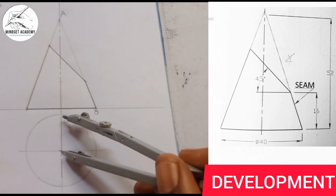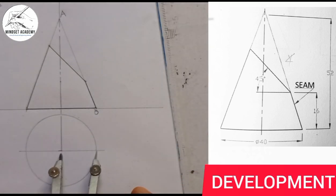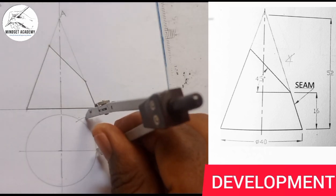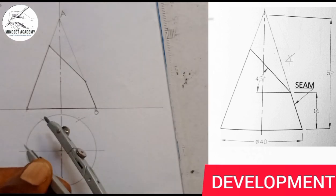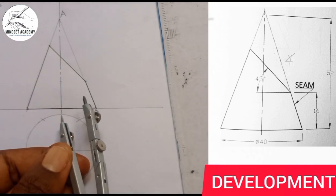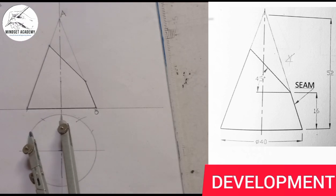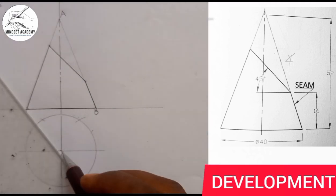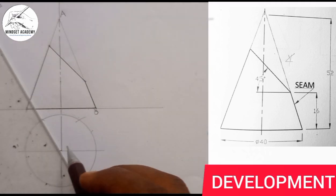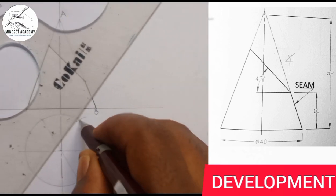With the same radius I come here, mark here, then come to this point and mark, then to this point and mark left and right. I take my instrument and pass it from each of those marked points on the circumference through the center of the circle.